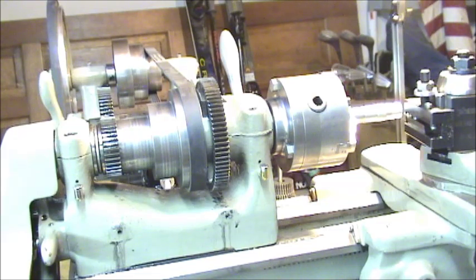The braze that I used, like I said, is not flux-coated. They do make flux-coated silver. From my supplier, at least, it was expensive. It was more expensive than a new back gear. That's why I didn't use it. I wanted to show you with what I had. Also, those other little bronze rods will probably work for you, too. They'll probably be a little bit easier to shape.